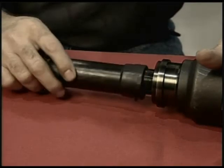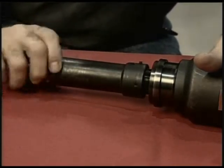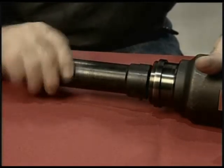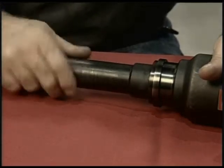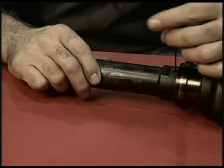As an alternative to torching, the optional collar cutter tool ensures clean, safe fastener removal. Attach the collar cutter thimble, just like the other nose assembly. Screw the thimble assembly onto the piston until the machined flat just disappears within the piston housing, just as you did with the nose assembly.